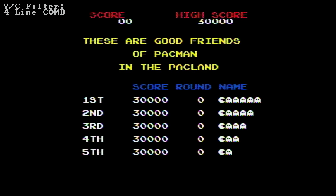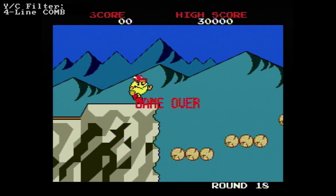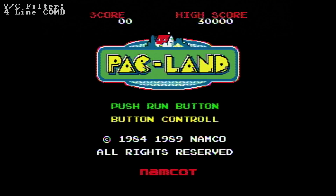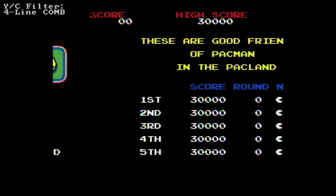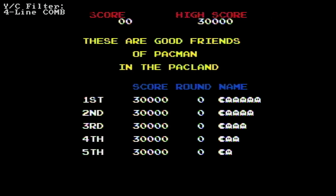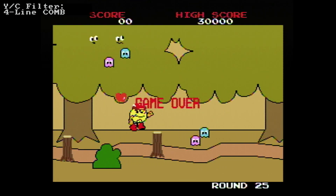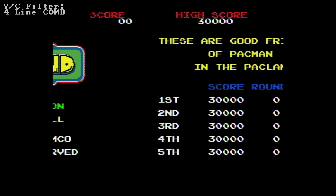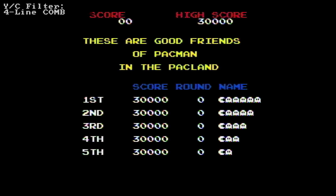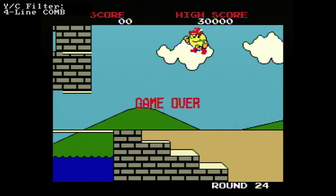The phrase 'you can't polish a turd' comes to mind. Now of course composite is much more acceptable on a CRT, so I'm in no way denigrating the use of composite. And in terms of the PC engine, the composite output is actually very good - one of the best consoles I've ever seen for just standard composite output, but certainly much better than the NES. So four line comb I would say is better all round in all cases - much better for static screens and marginally better for multi-directional scrolling, but not hugely noticeable. So now we've established that, I'll leave it on four line comb.